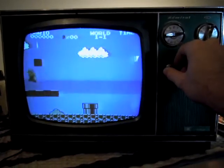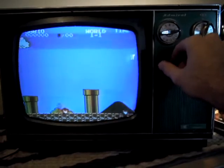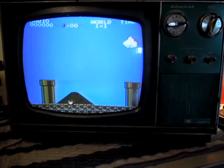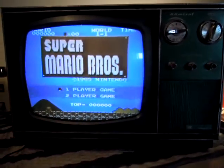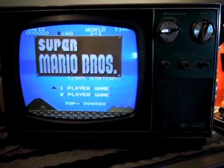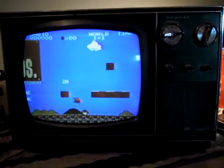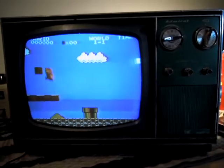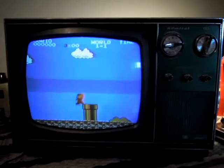But it's coming along. I'm just messing with it little by little. The color thing is really what needs attention. From my perspective the colors are really smeared and blurred, even if they look all right to you. Eventually this thing will get cherried out, and then we'll do complete setups and alignment on it, and it should be a pretty good little set. I still have yet to disable the instant-on feature, which keeps the heaters lit at all times. Since this has a good CRT, I'm not going to leave them burning all the time.